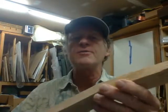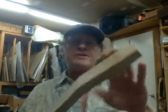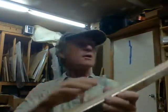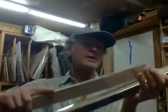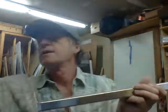I have some excess glue on here that I'm going to need to get rid of because I'm going to be adding some layers of wood on here. So you need this to stay perfectly flat, and I have this leveling beam that I use for leveling my necks and my fretboards, and it's got sticky sandpaper on it. In this case it's 160 grit. So I'm going to put this on the floor, and then I'm going to sand this back and forth until that comes off. Alright, so I'm going to reset my timer just so that I can be honest with how long this takes, and then I'll get back with you once it is all ready to get glued up.